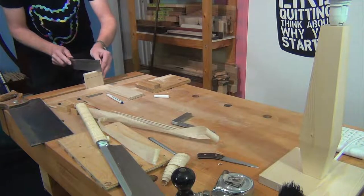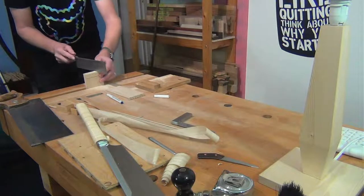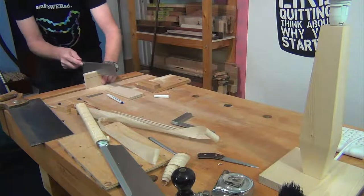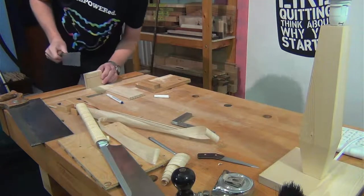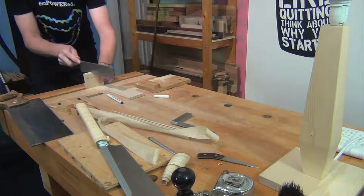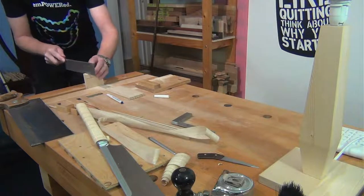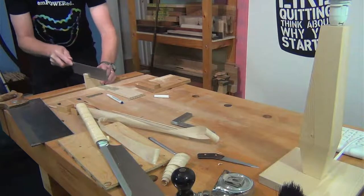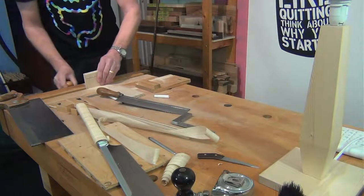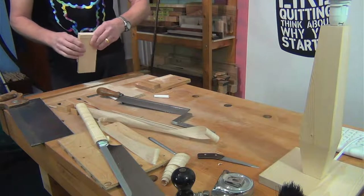He says it's for personal use — it needs some wood added to the sole and a new wedge. My question is: where does it need to be added to the sole? Is the mouth too wide? About the new wedge — just make a wedge. You can experiment with trying to match the colours, which is good practice for restoring other things in the future. Take it as a chance to experiment if you're not too worried about the actual value of the tool.